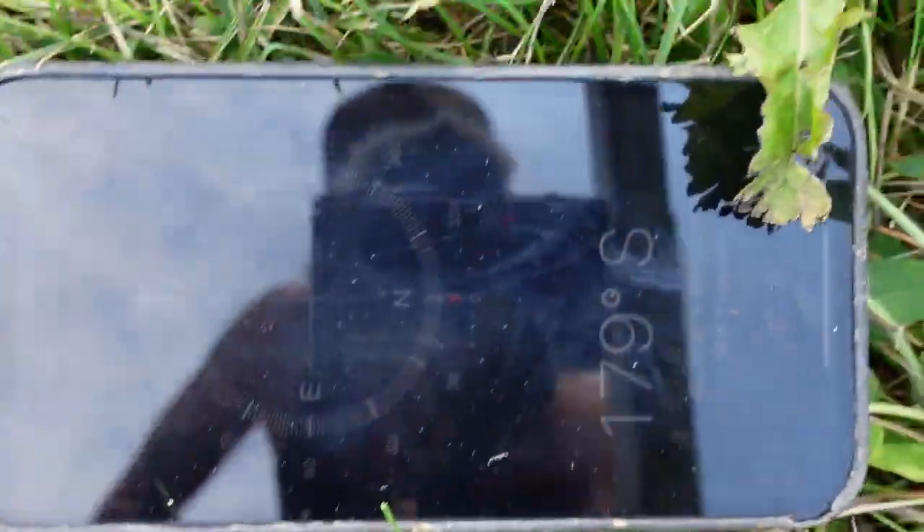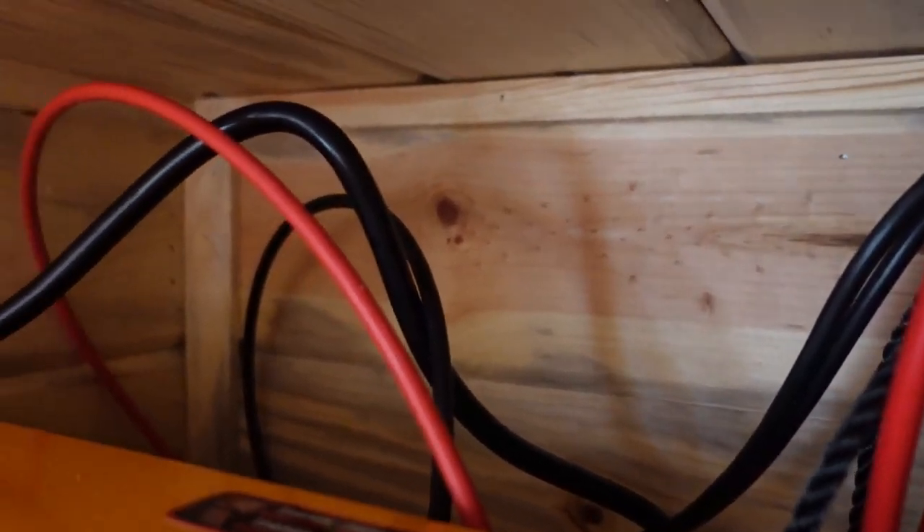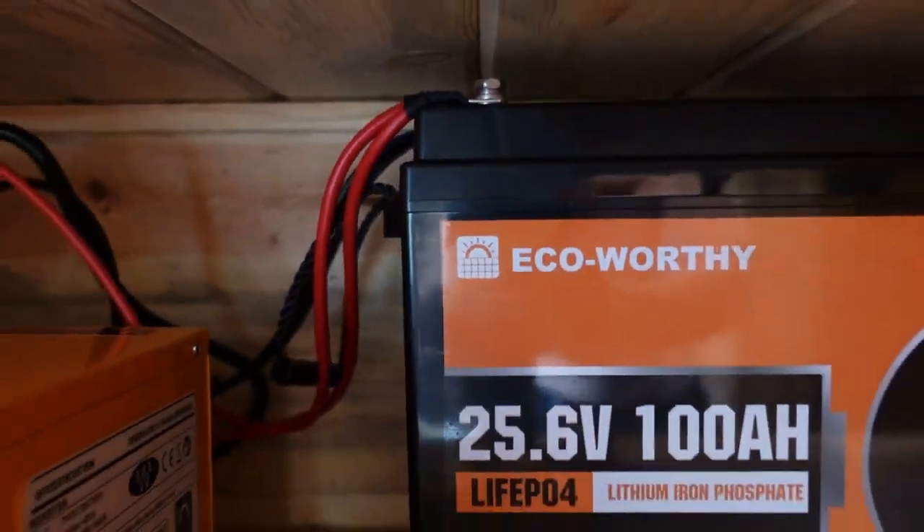My mounting system is outside with the solar panels facing south at a 45-degree angle for maximum efficiency. The solar wires run through the window and connect to the back of the inverter, and the battery connects there as well. You can plug it into the wall on mains priority or solar priority — if the battery dies on solar priority, it automatically switches back to main power to recharge. Think of it as a backup generator.